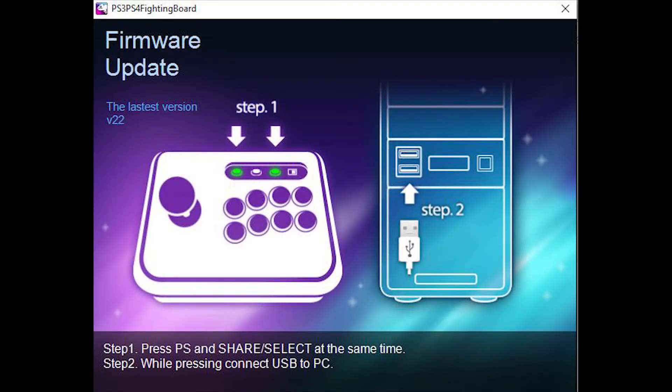The very last thing you're going to do is plug the fight stick into your PC and update the firmware. I will leave a link in the description that will take you directly to the Brook website's download page. Pick your fighting board from the list — mine is PS3/PS4+ — and download the program for either Mac or PC. Extract and run the program as administrator by right-clicking on it. It will prompt you to press and hold the share plus PS button on your fight stick. Keep holding them and plug in the fight stick. Then start the update and in a few seconds you're done.